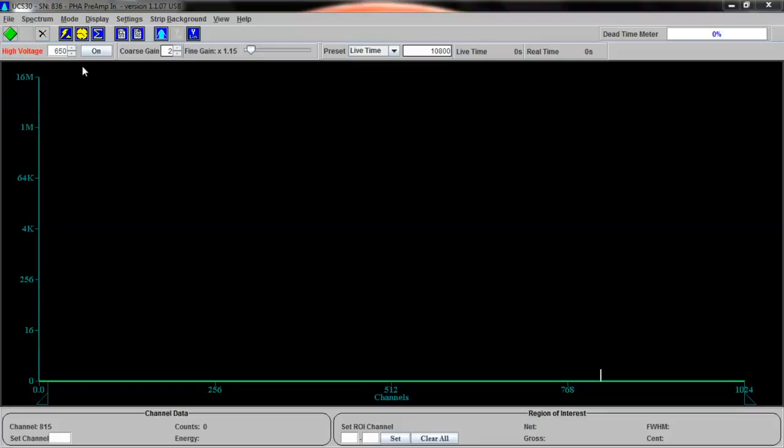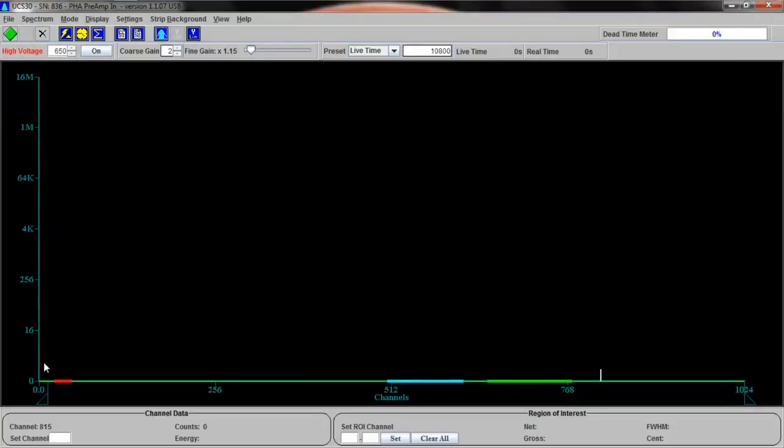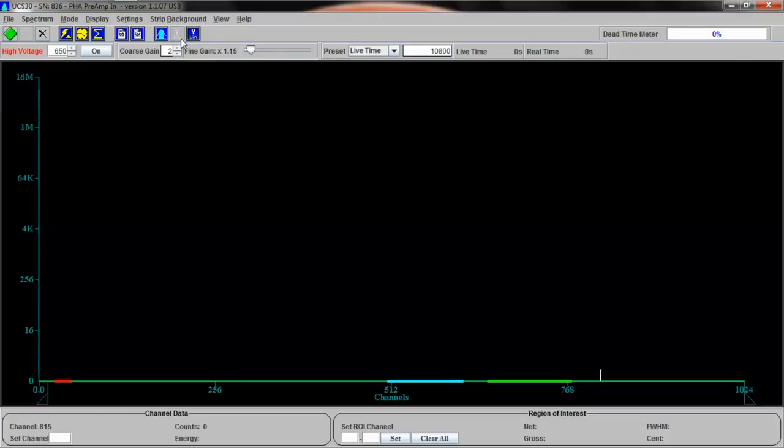All right, we're going to start out. We're in logarithmic mode right this moment, I believe. Let's see. Yes, we're in logarithmic mode. So 0 counts per channel, 16 counts, 256, 4,000, 64,000, 1 million, 16 million counts. If we switch over to linear, then we just go 8 counts, 16, 24, 32, and so on. And we'll max that out in a few seconds. So let's go back to logarithmic.